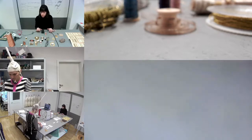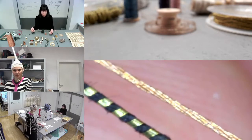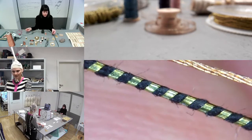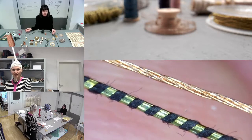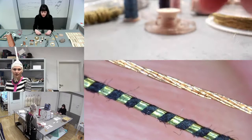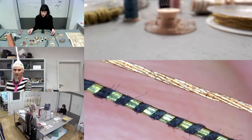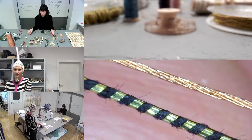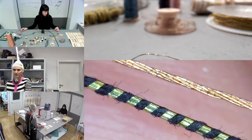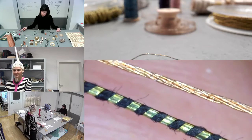Let's talk about conductivity of these materials. They're obviously quite conductive because they contain metal — copper, sometimes even silver or gold. But it depends on how much metal they contain. Comparing the Barton Francis single metal wrapped around a black core versus the Carl Grimm hy-flex copper: we measured four ohms per meter for the Carl Grimm, and around eight ohms per meter for the Barton Francis. That might not sound like a lot, but it can make a difference depending on your application. Also important: unlike in the last episode where resistance changed with stretching, here we always have four ohms no matter how far you stretch.